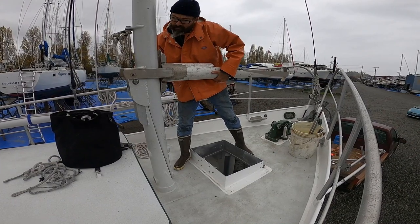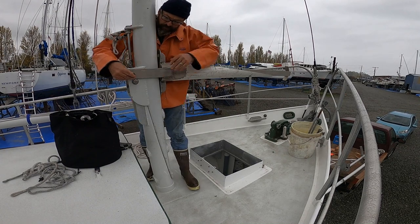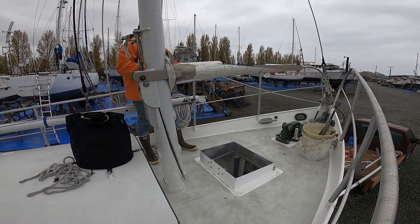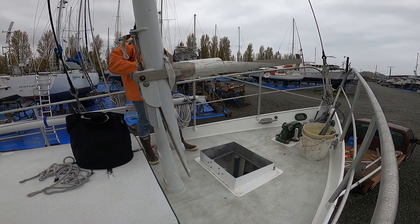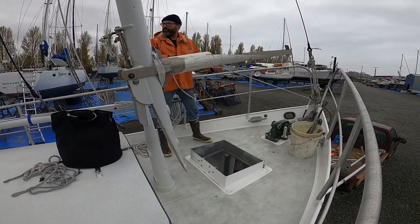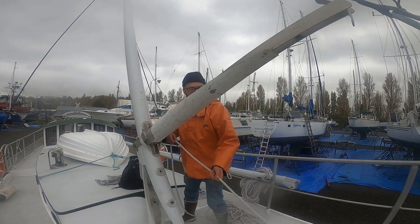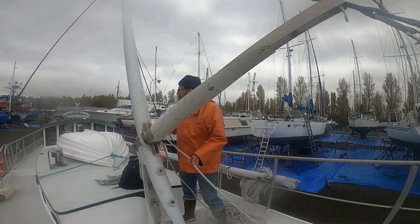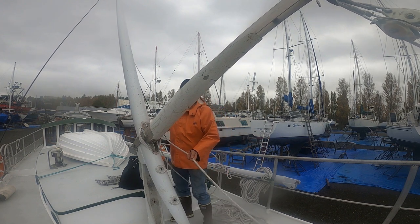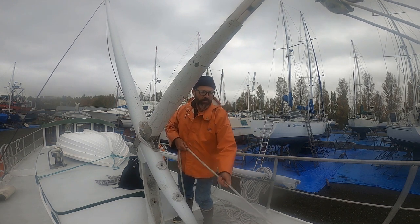The upper bolt — the fourth one — is installed horizontally and acts as the hinge. You can see that hinge bolt is just below the bolt I'm installing just now to affix the gin pole. I've got the lead of my tackle with a couple wraps around the drum of my windlass. To reverse this process I just simply crank the windlass with one hand and tail the line with the other, and it's really not much effort at all.